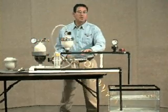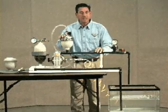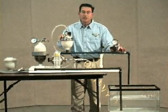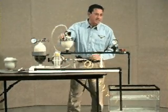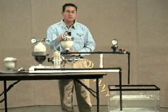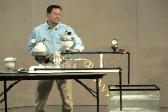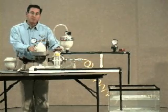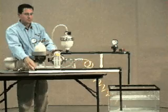By eliminating the pulsating flow, the pulsation dampener protects system piping from fatigue, protects gauges, enhances meter performance, protects transducers, switches, protects filter media, filter bags, and any other inline instrumentation. Whereas the discharge pulsation dampener protects the system components and piping, the inlet stabilizer protects the pump, its components, and the inlet piping or hose.